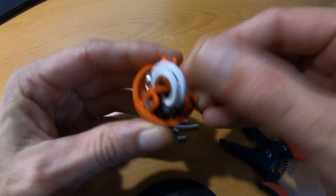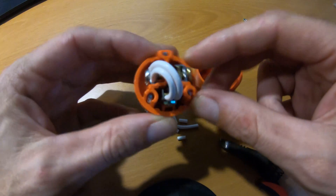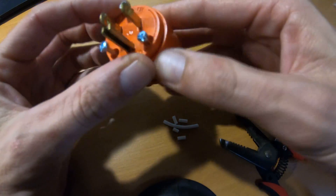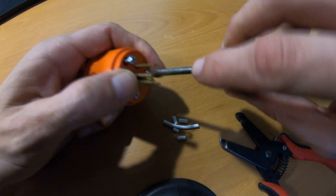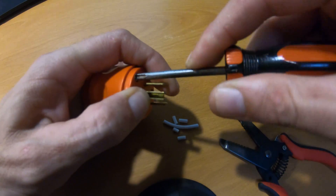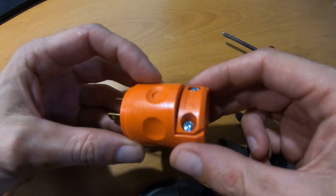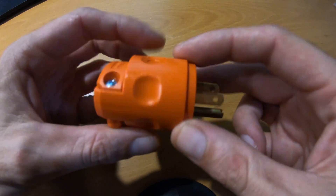Looking at the plug from the back side, I have the ground wired over to the neutral port and tightened down. All I need to do now is stuff it back in the housing and screw it back together. Then I'll take it outside and show you exactly what I'm talking about — surge protectors, generators, bonding plugs, how it all works and why you need it. This is basically the finished product.